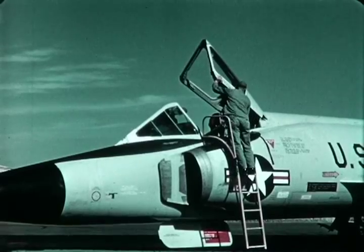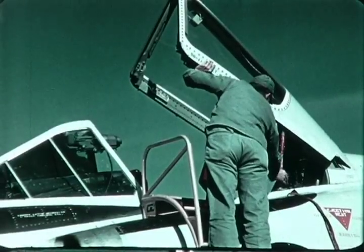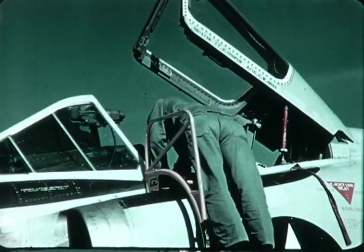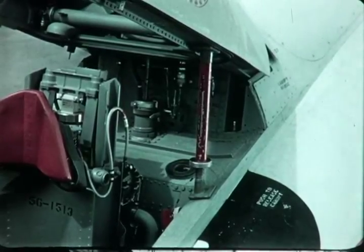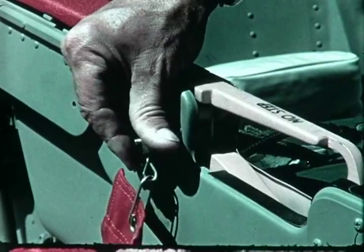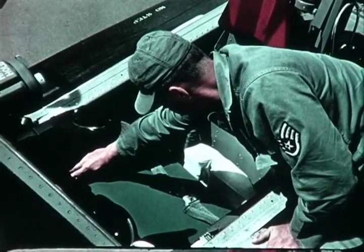Now let's examine in more detail removal and reinstallation of the kit by the technician. With proper canopy safety precautions taken, the next thing to check before entering the cockpit is that the 3 canopy jettison and ejection seat initiators are safetied and the ejection seat armrest safety lock pin is in place. Now you may begin removal of the global survival kit from the airplane.